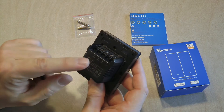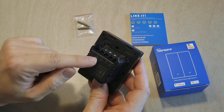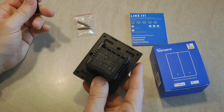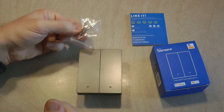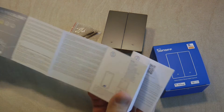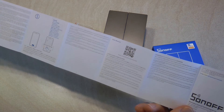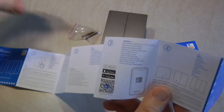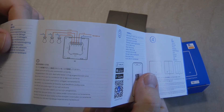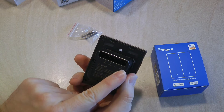There is no single-wire version available for these switches, at least not at the moment. Like the previous models, they are using a 10-amp relay, so you have 10 amps maximum current for each output — that's roughly 2200 watts or 1200 watts depending on whether you're in the US or Europe. In the box you also get some mounting screws and a small leaflet with a connection guide and installation instructions in five different languages, including the most important bit: the actual wiring diagram.